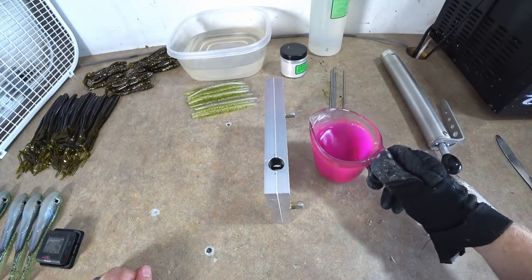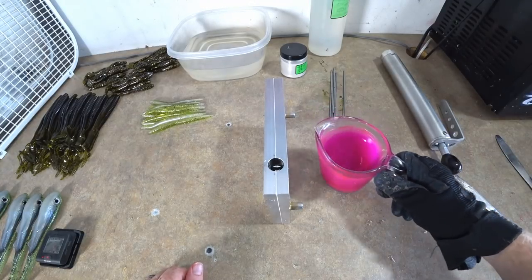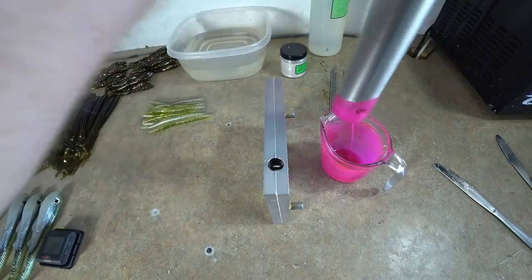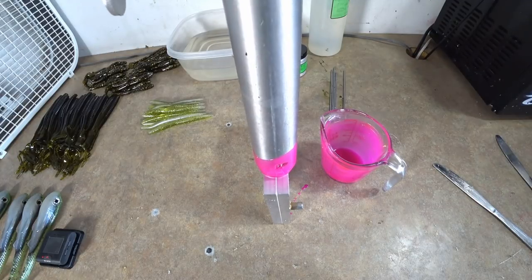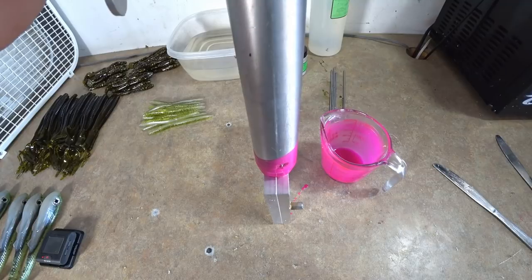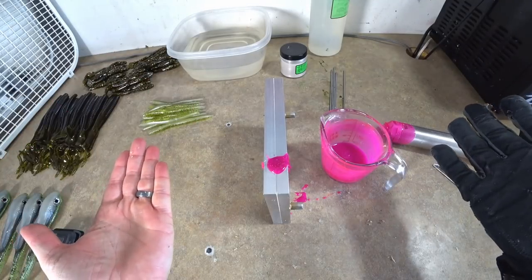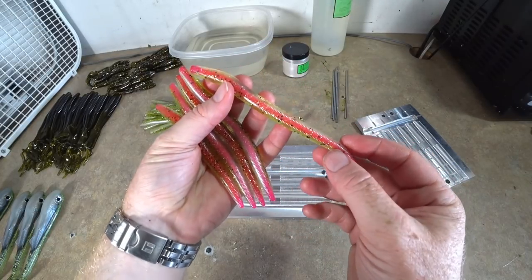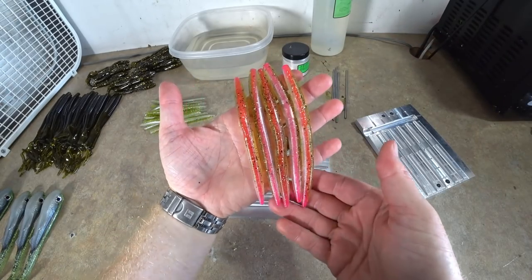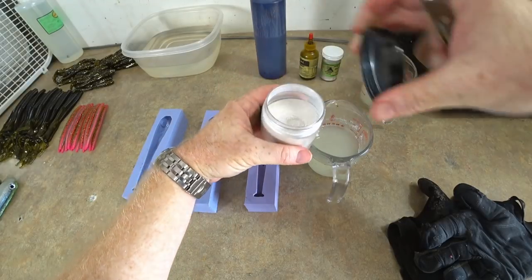We have some of our shells and we've inserted a few more back into the mold. Here's our pink core color — that's just remelt right there. Now we're going to shoot the cores. You want to shoot the core real hot and hold lots of pressure, because you want to make sure the plastic goes all the way through the shell. Looks good — and just like that, there is the rainbow trout core shot. You can see it from the side: watermelon on the left, pearl on the right, and the gorgeous pink line down the middle.